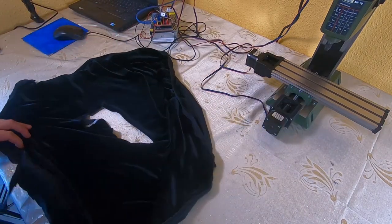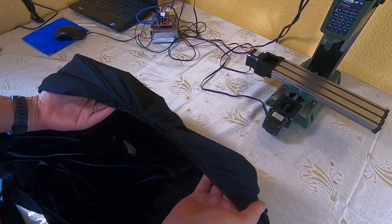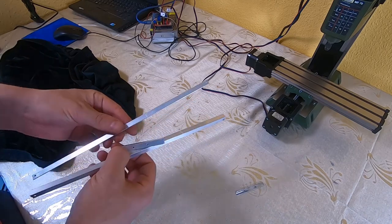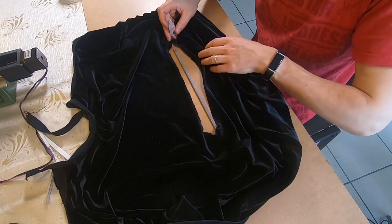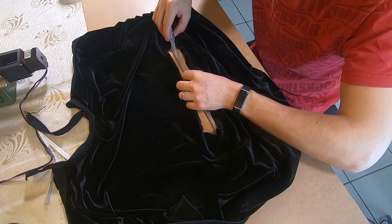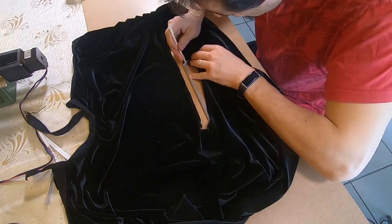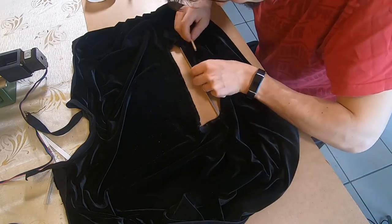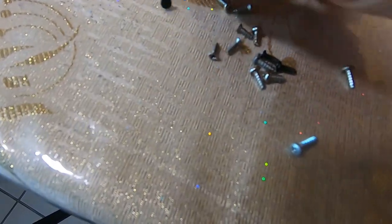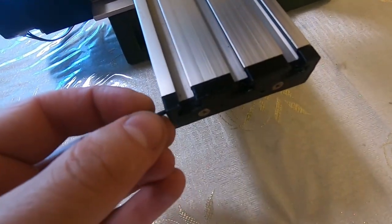The piece of fabric was cut a little bit bigger, to allow for the bed travel. It attaches to the sides of the case using these velcro strips, which are sewn on all four sides. In the center, it is fixed to the table using some aluminum profiles. For the first iteration, I used double-sided adhesive tape to fix the fabric to the aluminum profiles, but this time I'm going with superglue. Once this is done, the whole thing is fixed to the X and Y table using these small screws, which I scavenged from older computers. They go in the 3D printed parts.